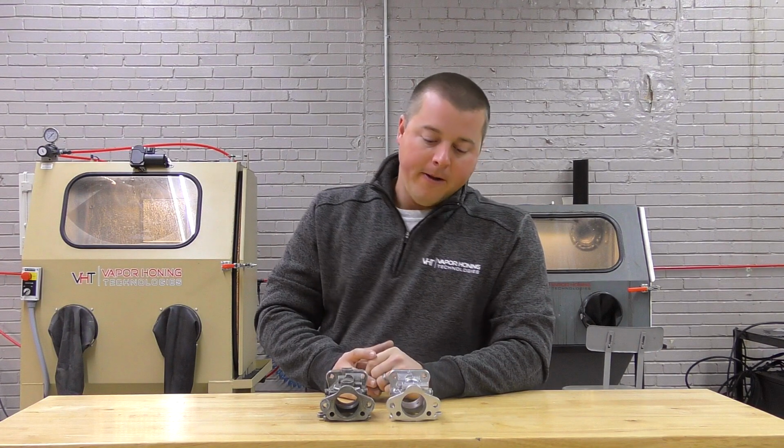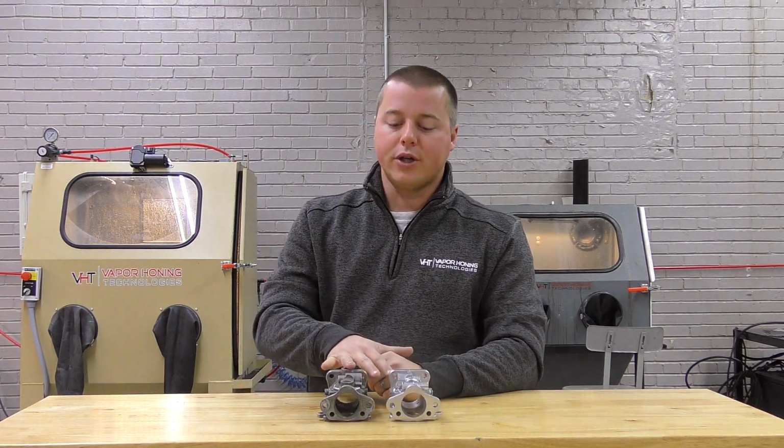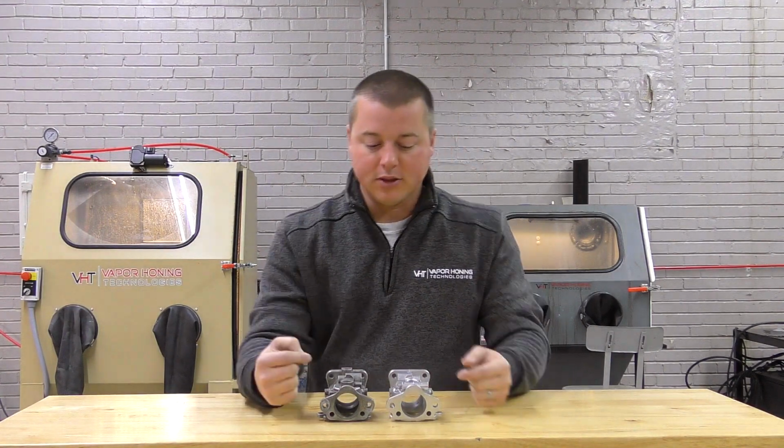This is not high pressure. This is not above 70 PSI. That's where we clean this part. Most people think it's thousands of PSI. It's not. This is very low pressure. Suspend the abrasive in the water and get this result and expose these cracks.